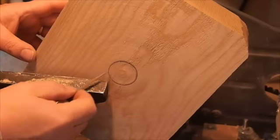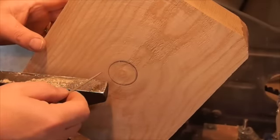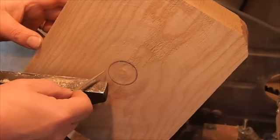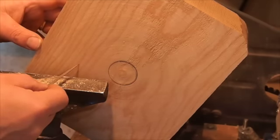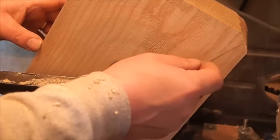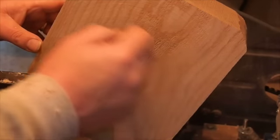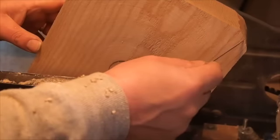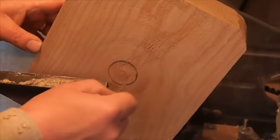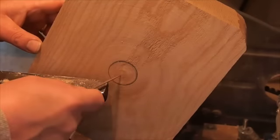You can see here now that I've marked up for the dovetail for the jaws of the chuck when I reverse this, so I need to leave this area. So I need to turn out now the bowl shape from the bottom of here, and as I work out here, I've got to come back down and leave these tips of the points of the square. So these are the pieces that will be resting on the tabletop. So I've got to work out the arc in there and the bottom curve of the bowl. But again, I've got to leave this because I need to reverse it later.